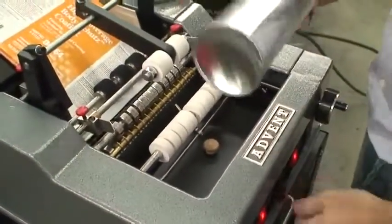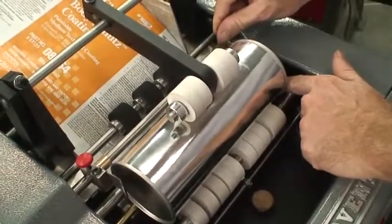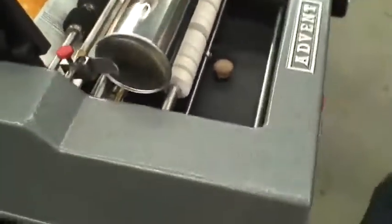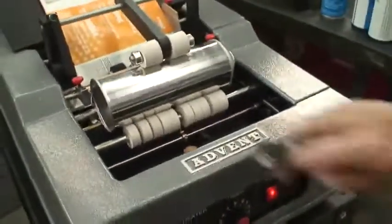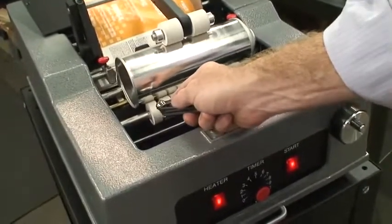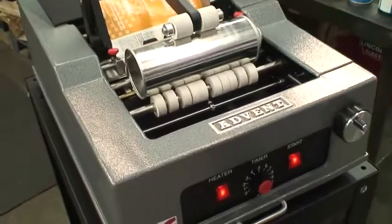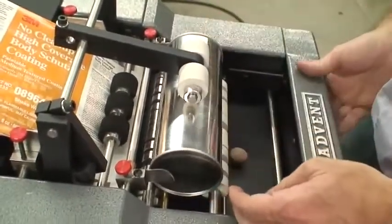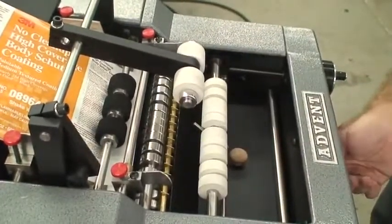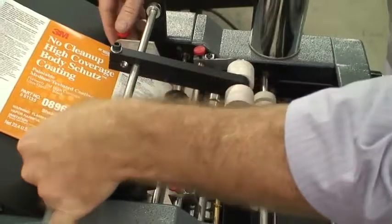I'm going to turn the timer to zero and hold the label back, then just insert the container. I want to see how well it's spinning — checking if it's jumping up or moving left or right — and it looks really good, nice and steady with good contact all the way across the face of the container. I can move the white tires out a little bit if needed. Then I adjust the guides — you don't want them too tight, especially with a metal container, so a little bit of play. I'll turn the time up to five and pop out the first label since the heat makes it curl a little.